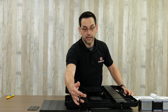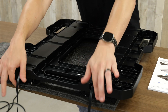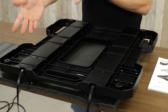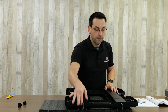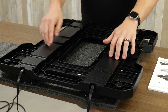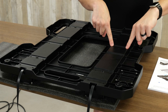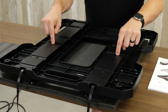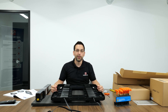Make sure all packaging is removed, then sit the base plate on top and route the cables up through the holes. Feed them through gently so they're not rotated or kinked. There are dowels that help center the plate - once those slide in you'll hear it clunk down, and there should be no gap between the rails and the base plate.